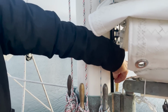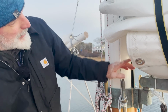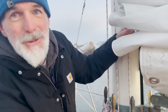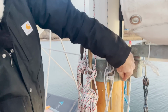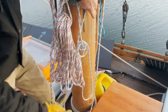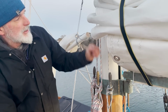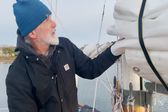So if we could get a point here, maybe a friction ring or something close to the track, that we could put a small strop like a Dyneema line through, and then with a hook, or I think we talked about a dog bone going through these grommets, coming down to the fixed point of that line, and could end here. Then you could have a block and tackle from here to here to tension that, and you could use it as a Cunningham under full main, and then you could just move it up to each tack downhaul point as you reef.